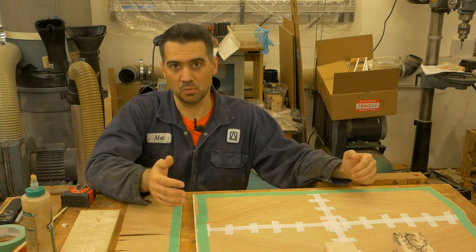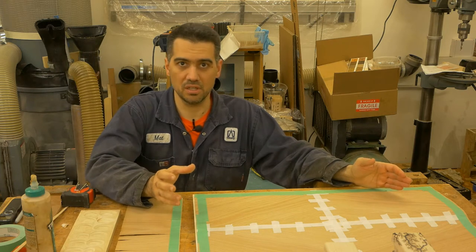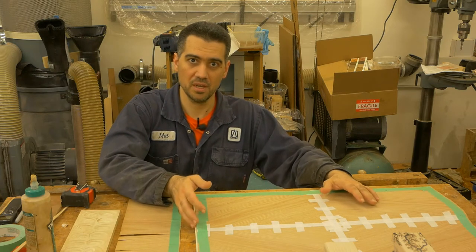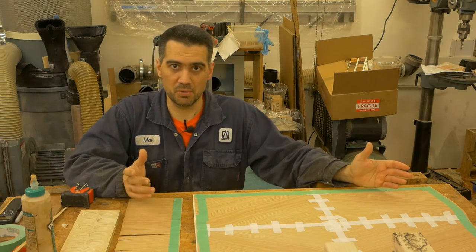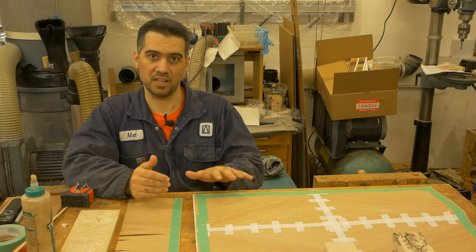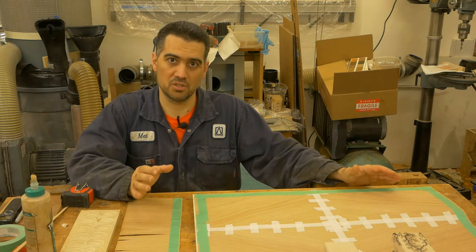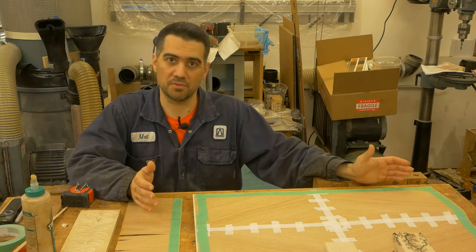Obviously, the height and the width will be different, but the one thing constant is going to be the thickness of glue that I needed on the surface of the wood. I did a scientific experiment because I cannot measure spilled milk with my instruments. I had 5 test beds, and on the surface of each test bed I had glue in 0.1 millimeter increments. So it was 0.1 through 0.5.